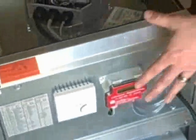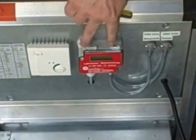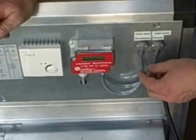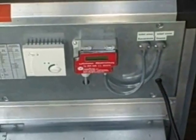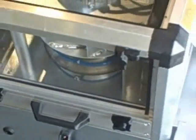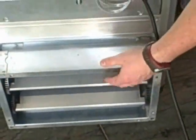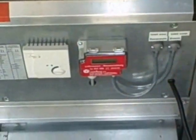Looking at our controls, we've got our potentiometer enable switch and our pressure sensor. The pressure sensor has two inlet tubes — one to the inlet cone area, which reads off the blue pressure sensor line from inside the back, and the other goes to the inlet area behind the damper. This reads the difference between the inlet cone area and the inlet area itself.